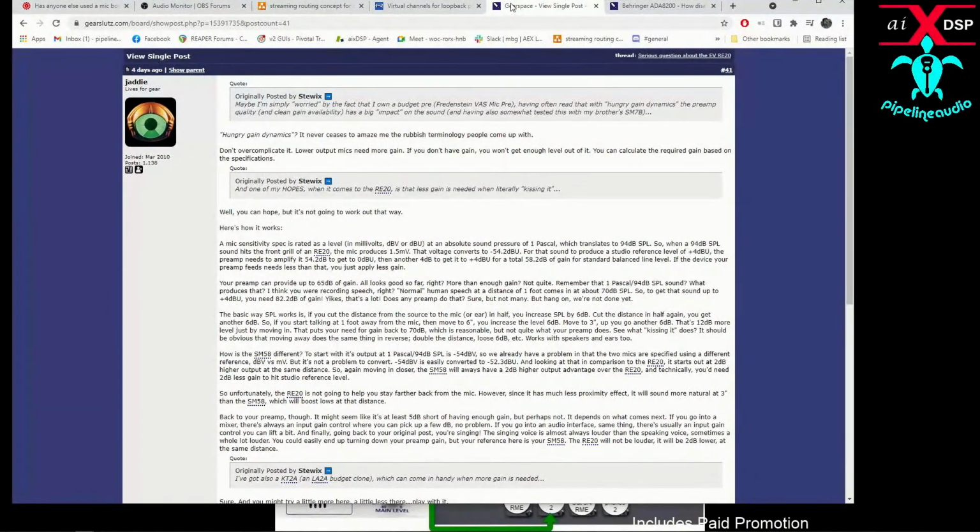Jaddy answers: Hungry gain dynamics? Scare quotes. It never ceases to amaze me the rubbish terminology people come up with. Yep. Don't overcomplicate it. Lower output mics need more gain. If you don't have gain, you won't get enough level out of it. You can calculate the required gain based on the specifications. And in this case, the self noise and the sensitivity specs are usually pretty accurate, and you can actually do an apples to apples comparison with them, and they're surprisingly right on the money.